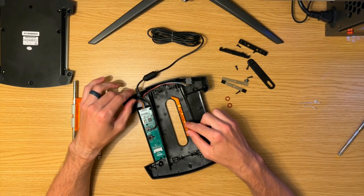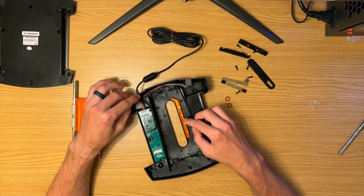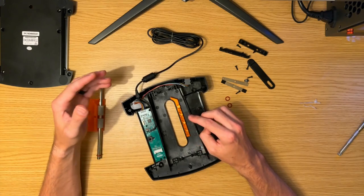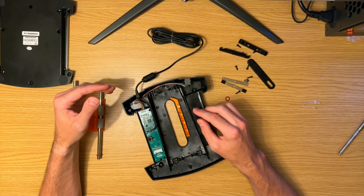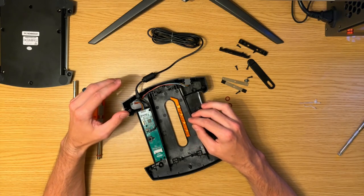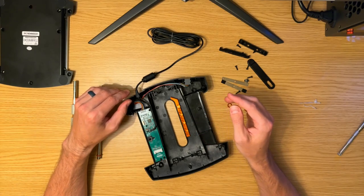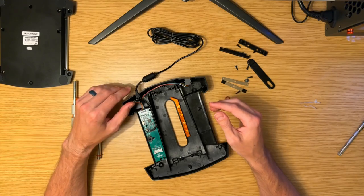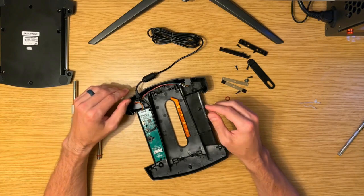You get the option to insert or remove magnets as many times as you want. They can also flip their polarity — if you want an attracting detent, if you want something you have to push through but doesn't actually hold the throttle in that position, or if you want an extra beefed-up detent that really holds it in the center position but also resists you pushing or pulling out of it on either side. Those are the new options and features for this.